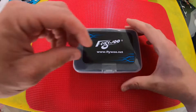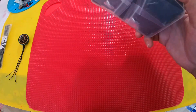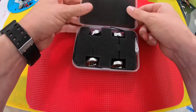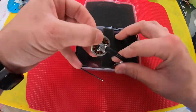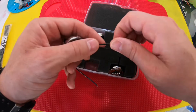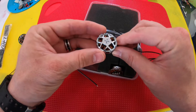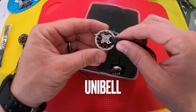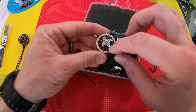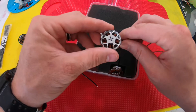Let's get this box open so we can take a good look at the motor. I bought a pack of four — you can buy them in a pack of four or individually. They're pretty good looking motors. They've got this chrome finish to them, which is pretty nice. Got some good long wire here, looks like 18, maybe even 16 gauge — I'll get a measurement on that. And yeah, the motor is looking pretty good, nice shine to it, pretty decent air gap. It looks like it's a 12 by 12 mounting pattern with M2 screws, so definitely for a smaller frame.